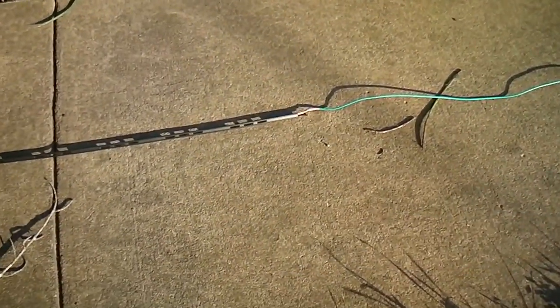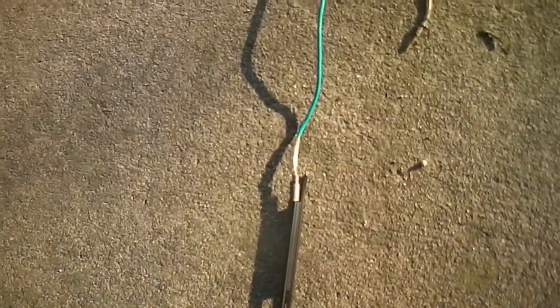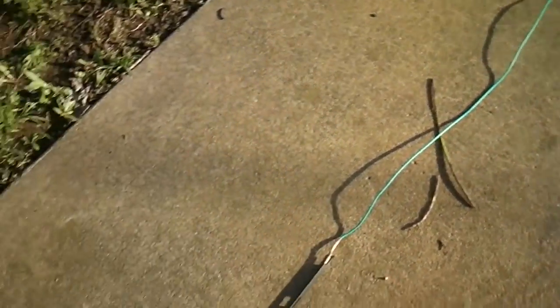You just hook it to one side of this 8-foot piece of ladder wire, or 300 ohm flat wire. And then down here at the bottom, it's soldered together, so it makes a J. Because this end up here doesn't solder to anything. Well, I'm kind of getting ahead of myself — I just couldn't help it.